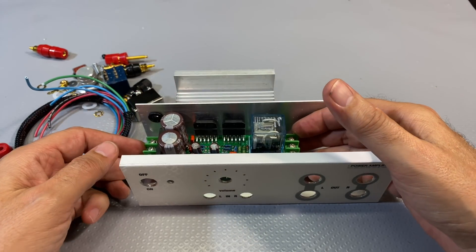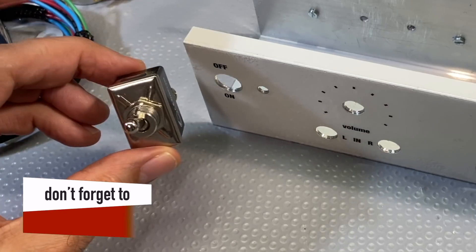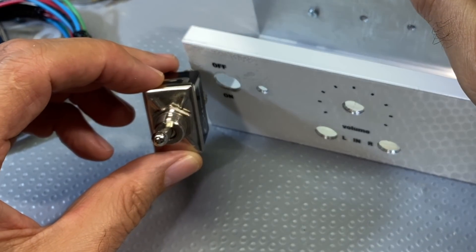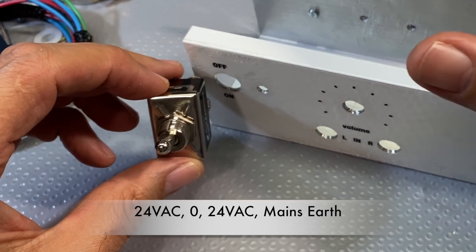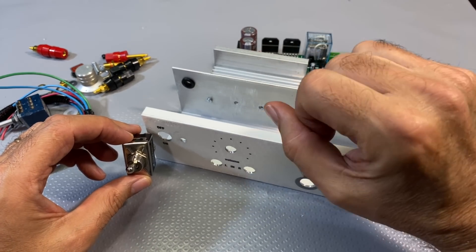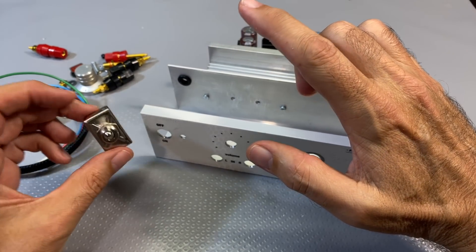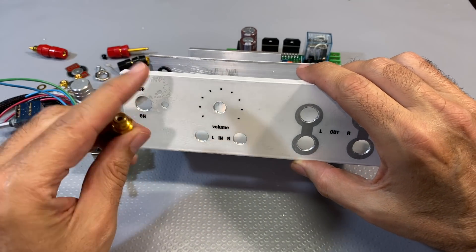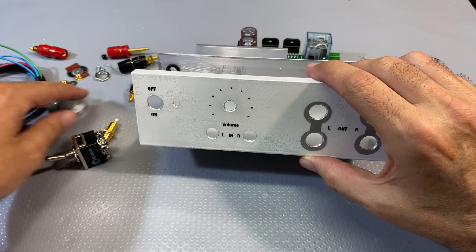This thing is getting fixed at the back. I've got a switch which is going to switch the mains going to the transformer. A wire comes from the mains into the switch, then goes back to the transformer, which sends three wires and a ground - mains earth if I want to connect it. I'll connect it to the chassis anyway. I may leave the option to leave it floating. There's an LED going on there. The left and right audio inputs come through RCA connectors - pretty good RCAs, and they're insulated so we don't have a problem with them touching the chassis.